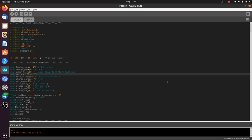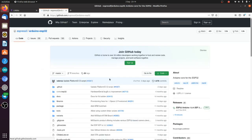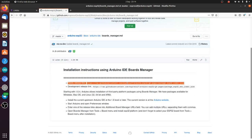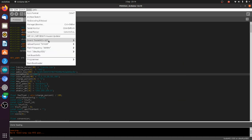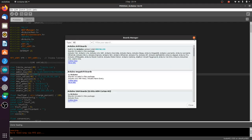Now we're going to run through the code. First, to install the ESP32 into your Arduino installation: Google 'install ESP32 GitHub', go to the official Espressif GitHub, go to installation instructions for boards manager, and it'll give you a URL. Paste that URL into your Arduino preferences and then the ESP32 boards will be available to you in boards manager — search for ESP32 and install it.